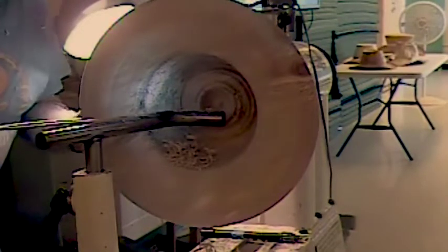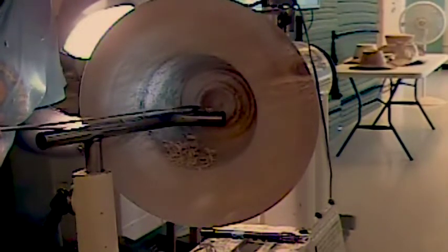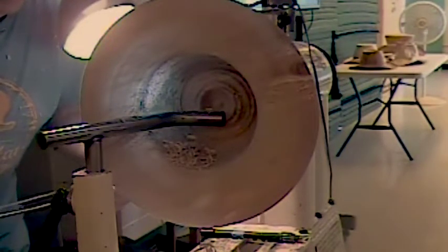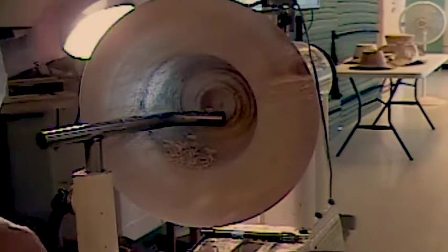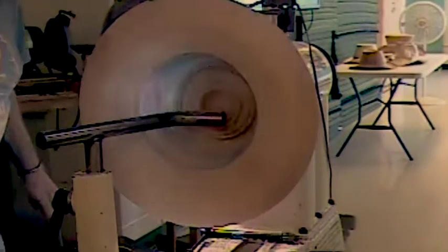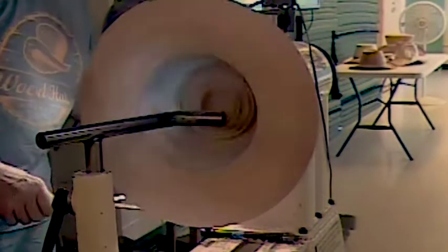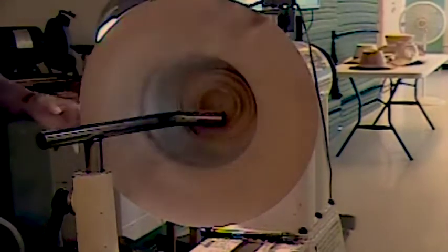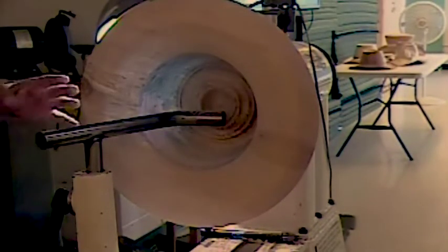Helpful to know. Oh, it's still thick. Up there, as far as I've gotten, it's still 5/16. So there's plenty of wood to cut. We're going to get some more light. So I try to leave this a big 32nd thicker than I want for a final cut, because what I'm doing in here is a whole series of cuts, one after another, trying to link them up.